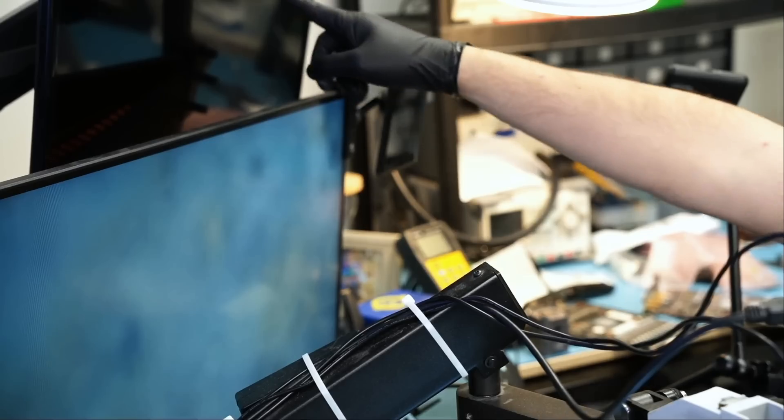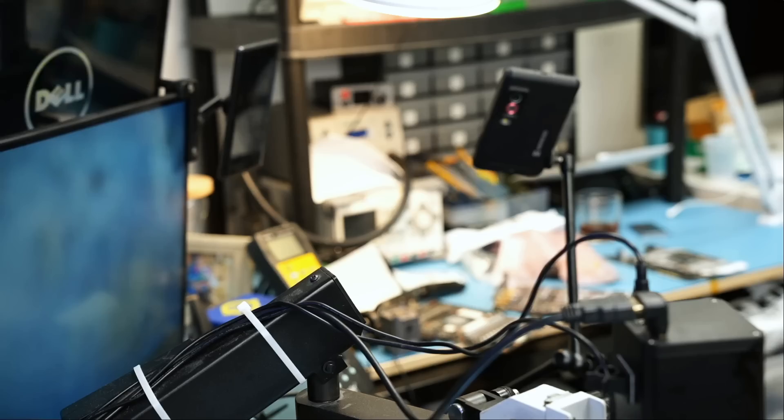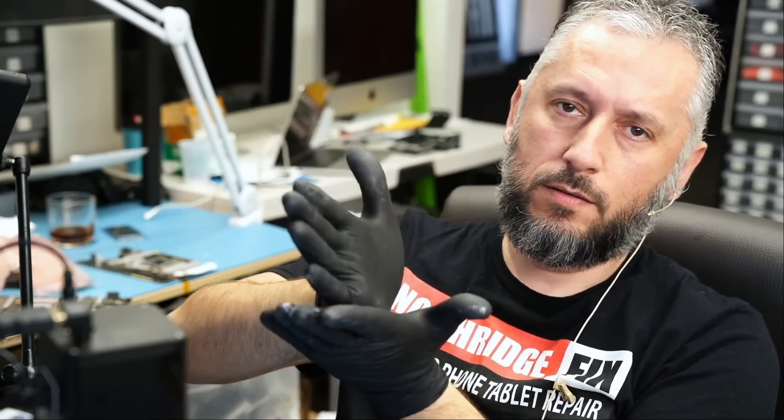We want to look at the top monitor — yes, it came on! Great, the card is working. We're going to have to let the customer know that when he plugs the card in the slot, he's going to have to make sure he does not peel off the layers. Plug it in at an angle, wiggle it left and right, up and down until it fits. Once the card is in, it's going to work. I'm glad that was a fix — we did not waste our time on the 12V HPWR connector for no reason.